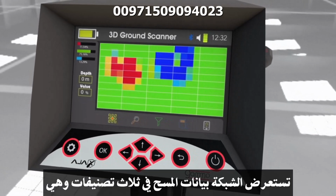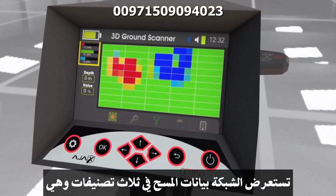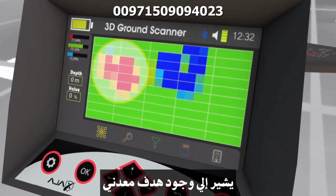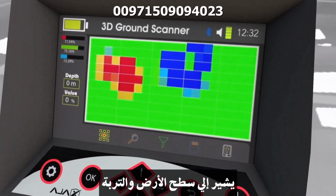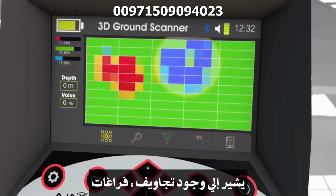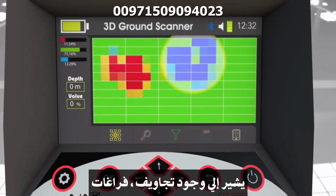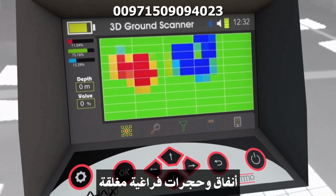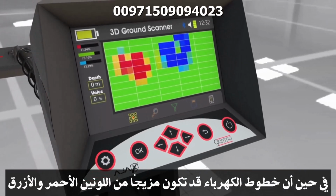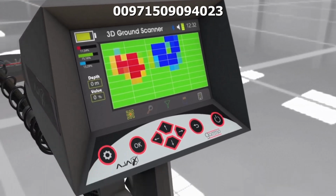The grid shows the scan data in three spectrums, which are: red indicates the presence of metal target, green indicates the ground surface and soil, blue indicates the presence of cavities, voids, tunnels, and closed empty volumes, even sewer pipes, while electricity lines might be a combination of red and blue.